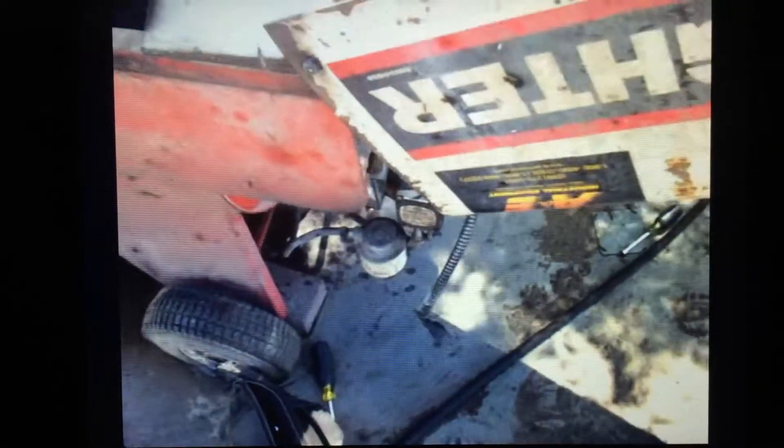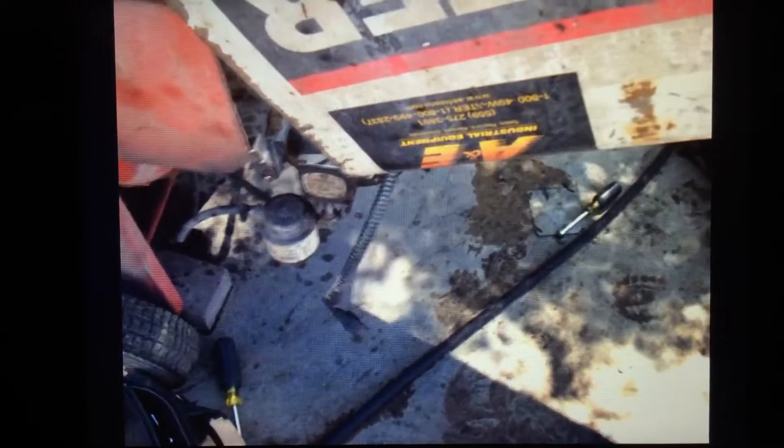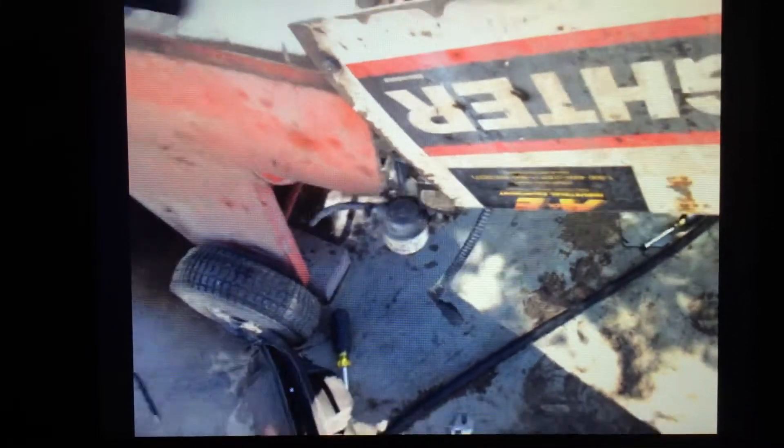I went ahead and bypassed this thermostat with a jumper wire, checked my voltage — made no difference. Came over here and took the cover off of the pressure switch, pulled it out, operated the micro switch — everything looks good, feels good. Still didn't make any difference. Every time I do something like this, I check for my voltage down there, operate the machine, plug it back in, make the rotary switch safe to operate, plug the machine back in again, call for burner, check for voltage. Still only at 120 — and one time I got 140, which is a goofy voltage to have.